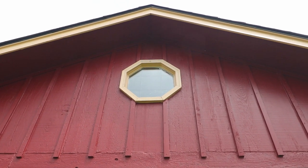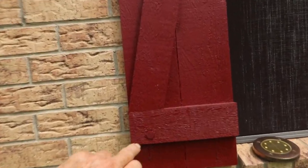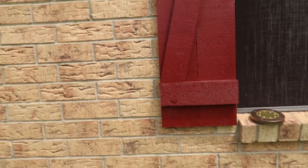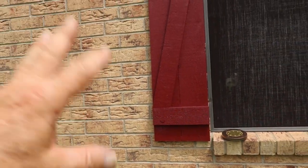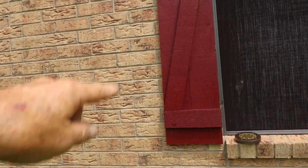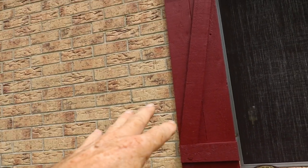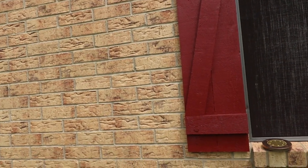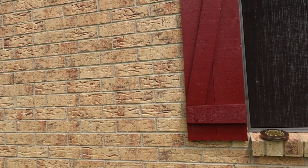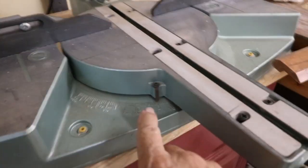You can read the old angle and copy it right to the miter saw. Another example: these pieces here were cut at a very specific angle. To make these new shutters to replace the old ones, I had to use a protractor to copy those angles exactly, because the wood was so rotten you couldn't even scratch a pencil to copy the original angles.